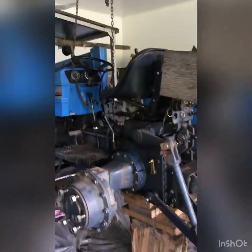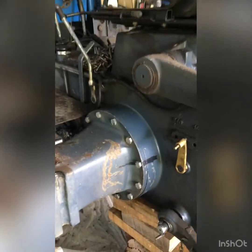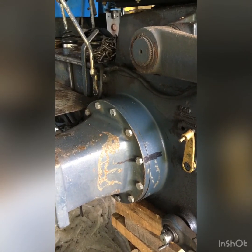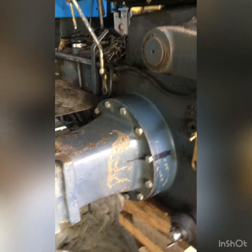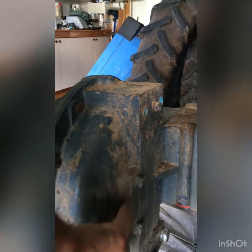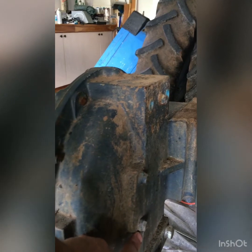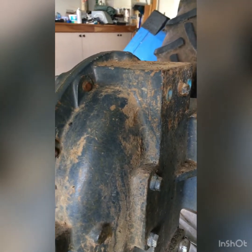So that's how it looked, the fender removed. Again, we marked the bolt. I think it's called in French cuisse, but I guess it's the wheel arm. There's some oil in the planetary, and you can fill with this bolt, and once it overflows from this bolt, it means that you have enough oil in the planetary.